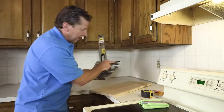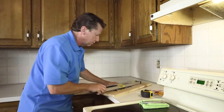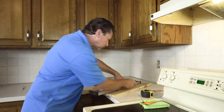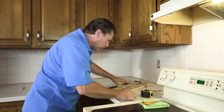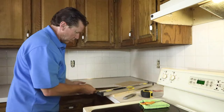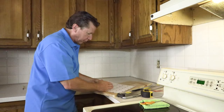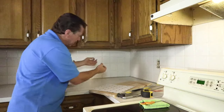Once you have your line established, you want to cut these tabs off like I mentioned. Line up with the brick right here — these inside bricks — with your straight edge, right on that line. Take your box cutter or your scissors, whichever one you prefer. After those are cut off, there's our first piece. When you start your first piece, do not peel off the whole backing at once — pull off about a third to almost half to start with, stick that on, then you can simply keep pulling the backing off, and that piece should go in there flush.